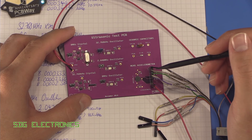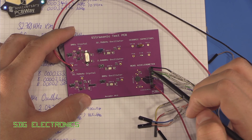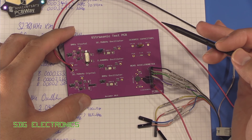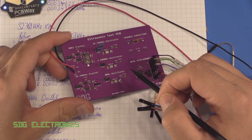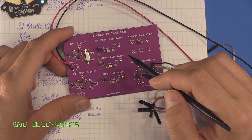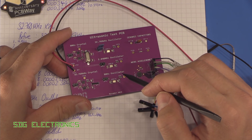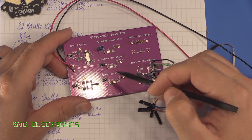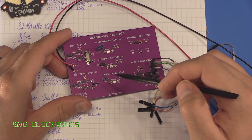What does this mean for ultrasonic cleaning? Basically, for most cases you're going to be fine dunking your PCB in the bath if you stick to reasonable time limits and use some precautions. Generally, if you put your PCB in the ultrasonic bath for about four minutes on each side, you get a completely clean PCB. You might want to check the temperature — this was cleaned at room temperature, but typically somewhere between 40 and 60 degrees is suggested. These components aren't really temperature sensitive in terms of storage, so that's going to be fine.